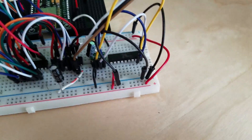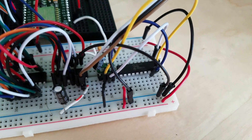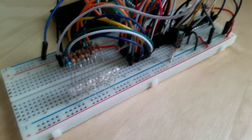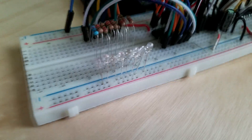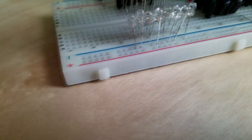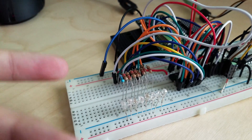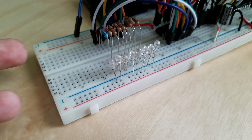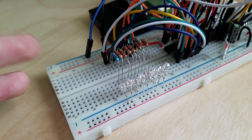That PSG chip is driven by an LTC6903 programmable oscillator, and that oscillator is just programmed right at the start by this little PIC16F690 chip. It sends parallel data from the shift register over to the PSG, and you can see this data on these LEDs right here — there are eight red LEDs showing the byte it's sending over, running at about 44.1 kilohertz, so 44,100 samples a second.